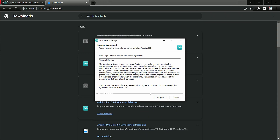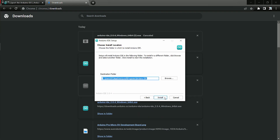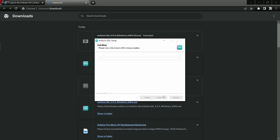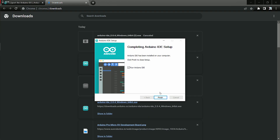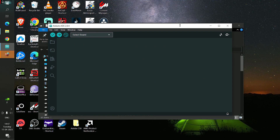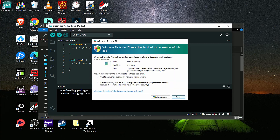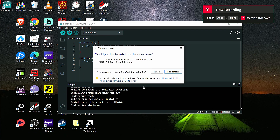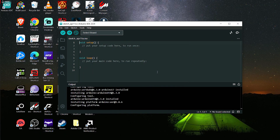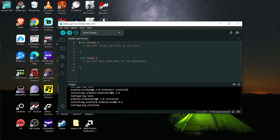After clicking the installer, you will see an icon — click on I Agree, then click OK, then click Next. Select the destination location and then install the software. After installation, select Run Arduino IDE and click Finish. The software will automatically run. If you get any firewall message, click Cancel. If it appears again, click Cancel again. If it asks to install Adafruit drivers, click Install and then Install again. Repeat the process and click Yes when prompted. All your drivers are now installed, and all your libraries including Joystick and keypad.h are also installed. Note: if you upload the code, keypad.h might give you an error, but that is totally fine and all buttons and encoders will still work perfectly.